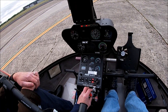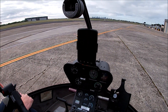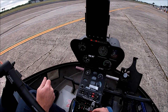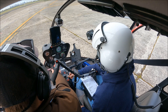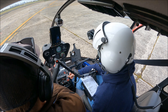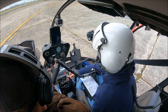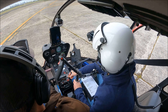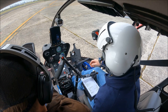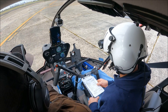Make sure this is well clear - all clear on the left and behind. Pressing the button. 10, 12, 14, 15 percent. Oil pressure increasing, lights turning, monitoring. Good start - first one's about 690 degrees. We can hear the engine accelerating, so we're comfortable it's not hanging. N1 is increasing. There's 50 degrees, 60 percent - beautiful. We are self-sustaining. Stable at 60 through 63 percent.